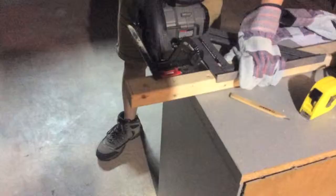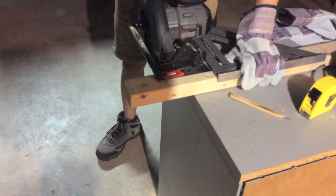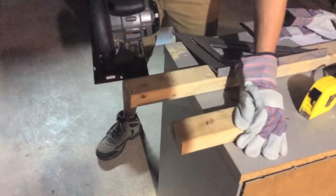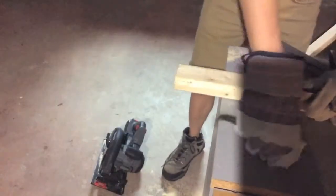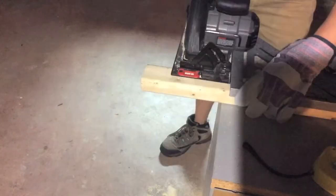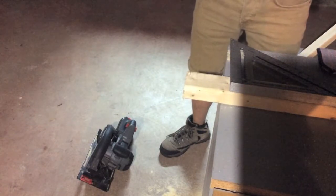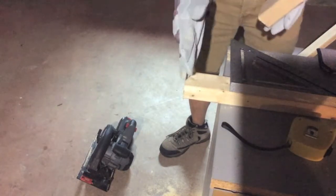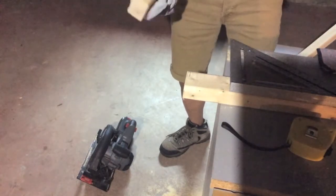Put all pieces to be measured out on the one big piece that you're cutting off. Because if you have to cut a piece you already cut, it's a lot more precarious to cut it like that than it is to cut off four inches from one long piece. When cutting wood, you also have to account for the blade size — that's going to be like a quarter of an inch or so. If you mark it off and cut right where you marked, you're usually going to lose a little bit of wood because you don't account for how much the blade cuts off. So I always do it a little bit past the mark. If you have more room to work with, it's a lot safer.